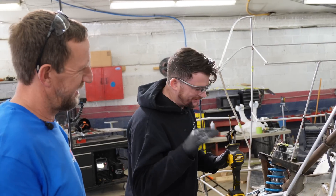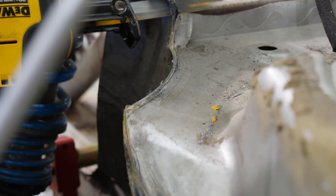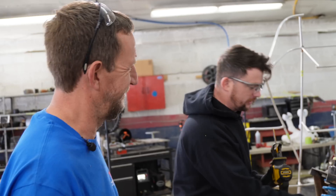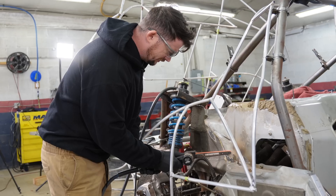After that whole spiel about spot welds, this one little four-inch segment right here reversed the other way. But I'll just weld the edge — it'll be just as strong. That little bit of flange there is not going to be any stronger than if I just run a big weld all the way through across.